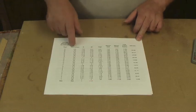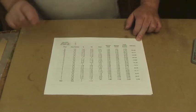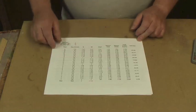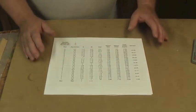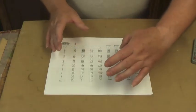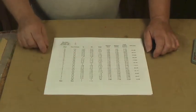This is the spreadsheet. The part that's going to be different about this is each alternating ring is going to go from 3/8 to 3/16. 3/8, 3/16. And what I'm going to do is between each row, I am going to offset by, I believe, 1 degree. That I'll have to see when I actually get it put together. But each row is going to rotate a little bit clockwise, and it'll cause it to spiral without actually changing the blocks.